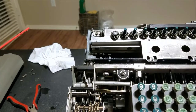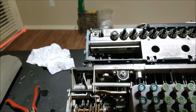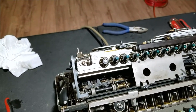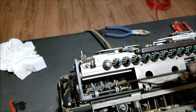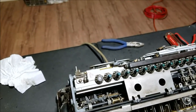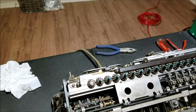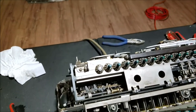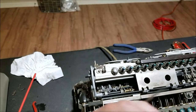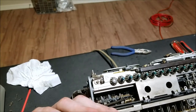So the issue with the last digit of the carriage getting stuck — down in here are the counter actuator mechanisms. It's just a big long bar with a bunch of little swivel-y things on it. The bar rotates or goes back and forth, and these little fingers hit the wheels and advance them to the next position. They're spring-loaded because when it wants to carry, normally it'll hit like that and not engage the next wheel until it returns to its home position and then falls back to the normal place.